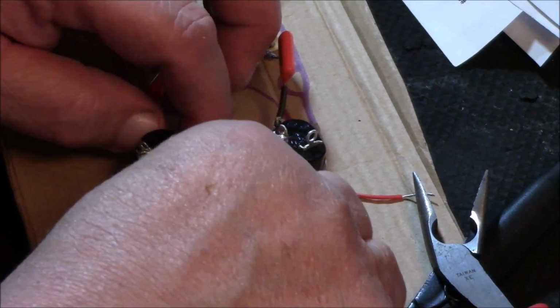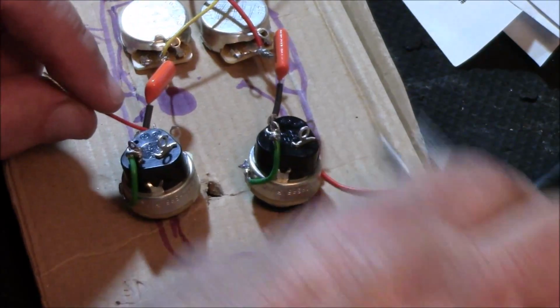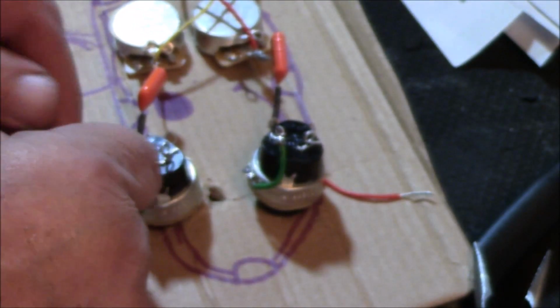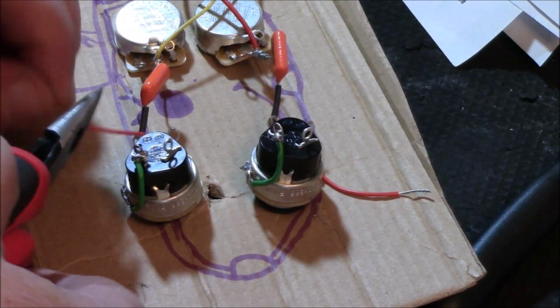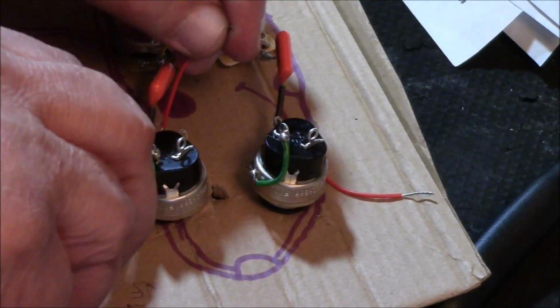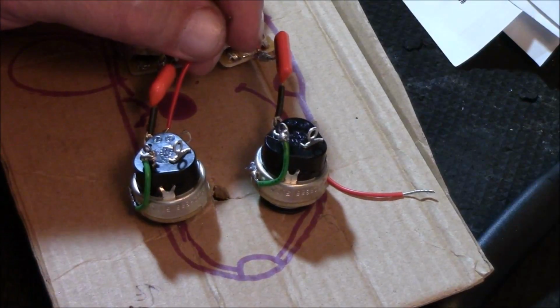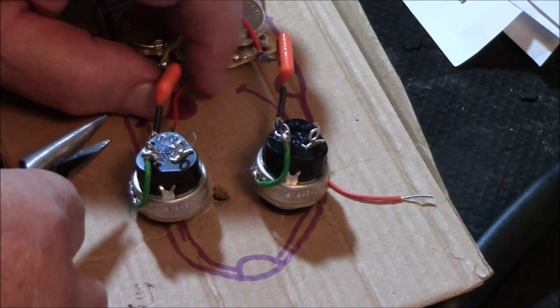That's the biggest nightmare, to have a short or a hum or a buzz because you've got wires that have shorted against each other. And it could take the tiniest wire, guys, to do it. Just one single strand of this 22 wire, if it's touching the wrong part, you will get a problem. Your circuit won't work. That's what's very frustrating sometimes. And that's another reason why a lot of techs have these big magnifying lamps like mine. Which mine's giving me fits right now. And so is this thing.